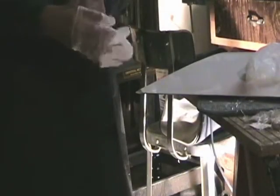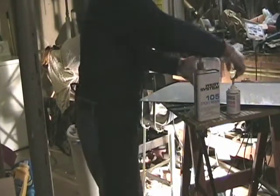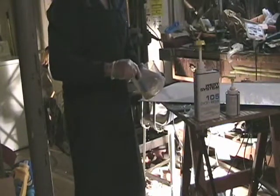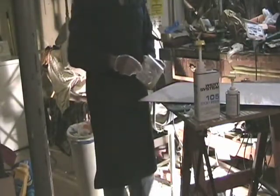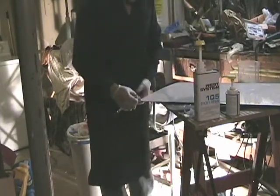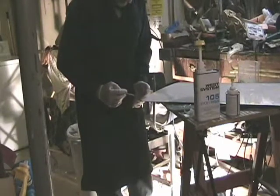I'm going to be using epoxy resin for this repair — it has 20% better bond strength to the cured polyester resin that's already on the blade. Always use gloves with epoxy because you'll get sensitized to the resin otherwise. The proportions on mixing the epoxy are very critical; the West System pumps make this a lot easier. I like to paint the epoxy on the surface and then put the dry laminates into it. If you dip your fiberglass cloth in the resin first, you'll get way too much resin between the layers, and that's very weak.